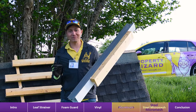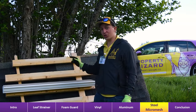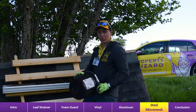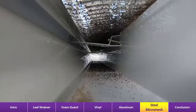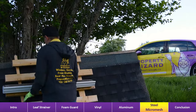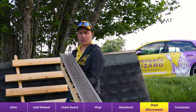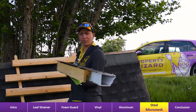Finally, we're down to the surgical mesh — this is supposed to be the magic one. Will it work? Should you install it? While it's brand new and clean I can actually see through it, which is pretty awesome. This is real gutter butter that we pulled out of gutters around Victoria. Now let's simulate cleaning it off with the leaf blower — you could also use a pressure washer to blast out all the bits of dirt perfectly well. Out of all the options here, that is going to be the finest dirt that has landed through any of them, so if you don't have too many trees and you want the best of the best, this is going to do it for you.